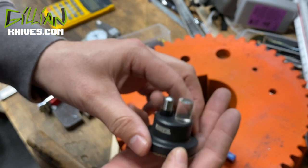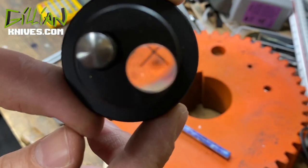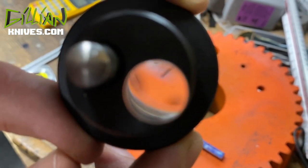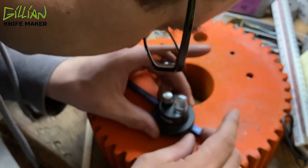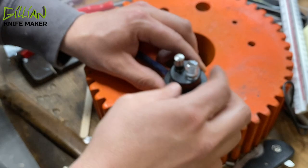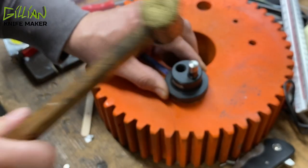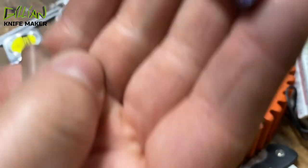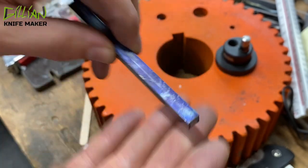Very simply, I'm going to look through the glass, and inside that glass is a set of crosshairs. I don't know if you can see that or not. I'll take out my sight glass and put it in my center punch. There — I've center punched directly on top of the crosshairs.